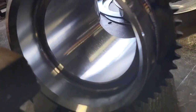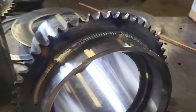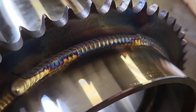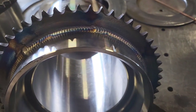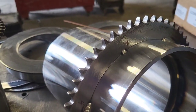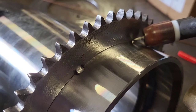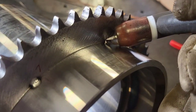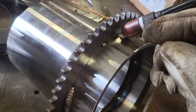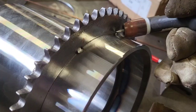I've got this standing on some little blocks there to support it and keep it from rocking back and forth while I'm welding. Everything plays a factor in making welds like this — rod choice, heat, everything is such an important factor, not just one single thing. Do not start welding until you are 100% comfortable with everything you're fixing to do. You've got to make every step exactly like you did before. I'm laying the torch at a push angle and laying the cup actually on the pipe and just dragging it, following my hand around and making nice consistent steps.